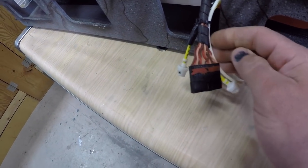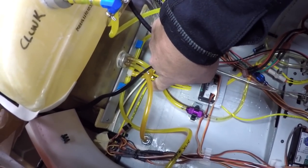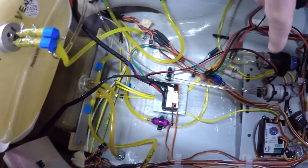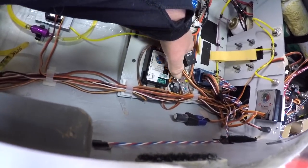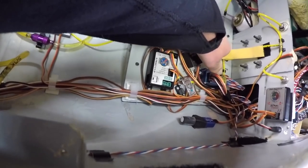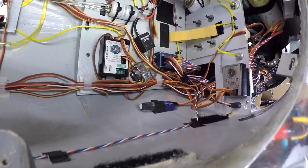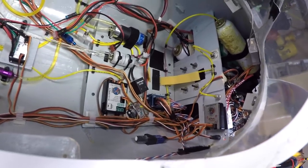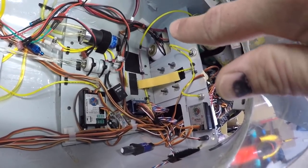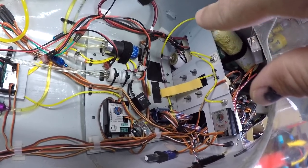We can eliminate the brake line. The brake system is fairly independent of the main air system. This T right down here is the brake line — that lower one — and it comes to this Jettronic valve. This is the main door valve, so this Jettronic valve can be eliminated. There's a T right behind the gyro which feeds the main gear doors and the brakes, so it'll be fairly simple to redo the air system. We'll still be able to use those two air tanks.